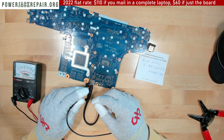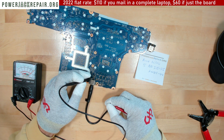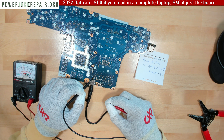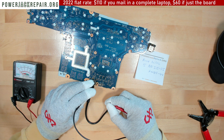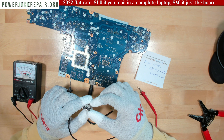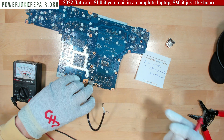Let's take a look — we do get voltage here. That blackness is what I'm not sure about; maybe it's oxidizing and not making good contact. Let's check the other pins. That's a positive. We've got two positives — three positives! All three of those pins in the back are positive. So how does the circuit work here?